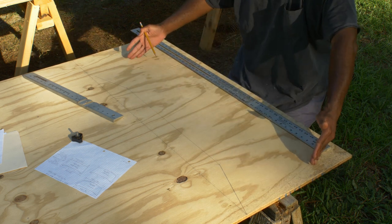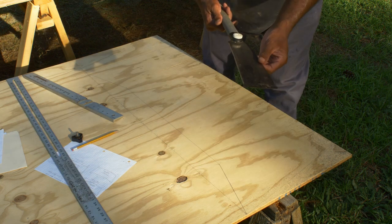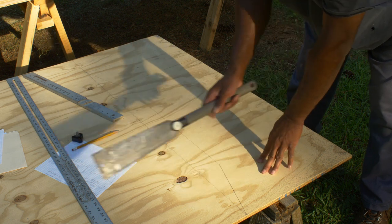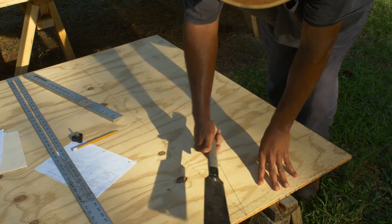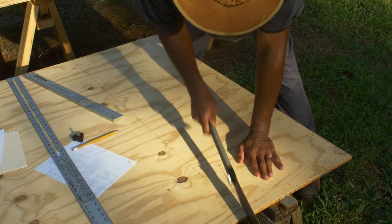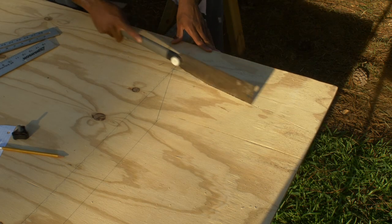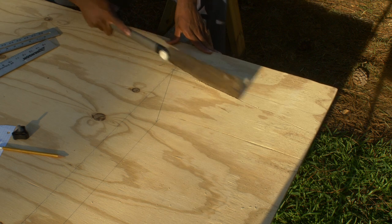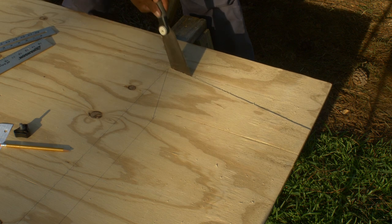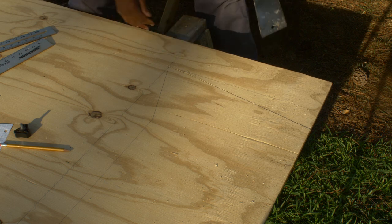That gives us a 36-inch wide, 18-inch high hole. Japanese pull saw — two sides: the bigger teeth go with the grain, the smaller teeth go against the grain. Power tools are great but I find this is more accurate for me. It doesn't require a lot of muscle, just a lot of time — it just shaves away a little at a time. Take your time, and that's it.